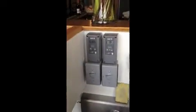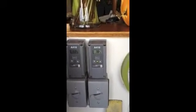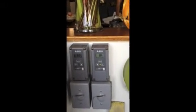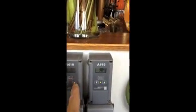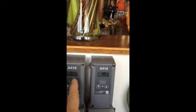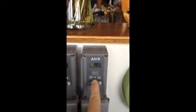These are our two controllers — they're just Johnson controllers. Each controller has two things that come out of it: one is a small power source wired directly to the solenoid valve attached to the fermenter, and the other is a temperature probe that goes to the fermenter. This one here has beer that's fermenting right now. If I click it to the set point, I have it at 70 degrees — so if the temperature during fermentation goes up to 70 or 71, it clicks on the solenoid valve and allows glycol to go through, which is what's happening here. That's why you see the light.